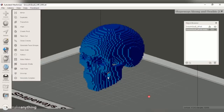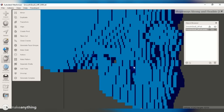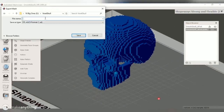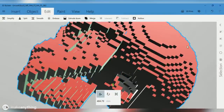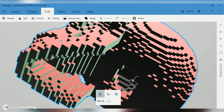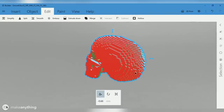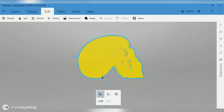That's pretty much all we've got to do in MeshMixer. You can see there are some parts down here and on this side of the jaw that didn't actually turn into cubes for some reason, so I had to go ahead and fix that in Fusion 360 before coming back into 3D Builder to do that paint job. Here you can see the final result — I put a hole in the bottom here because when you're creating hollow parts with powder-based 3D prints you need a point for the material to come out, and this will also make a nice fixture for a stand. Coloring all the sides on this model was definitely a lot more work because you've got to go into all the different nooks and crannies and make sure every face is the right color.